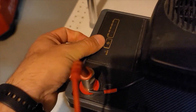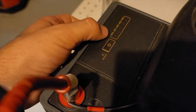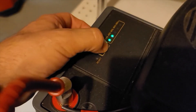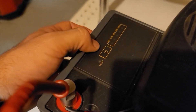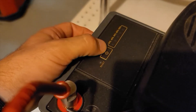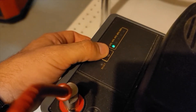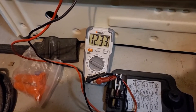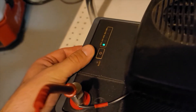You're supposed to push the button. When the light starts flashing, you push and hold it until the light clears or goes solid. So it flashes — did the BMS just reset? What just happened? I've never seen it do that before. I think our BMS went into safety mode. Either way, it shut down. But when it did that, we got voltage back — we went from 0.1 volts to 12.3 volts. I think the BMS shut her down in safety, but she's still reading dead.